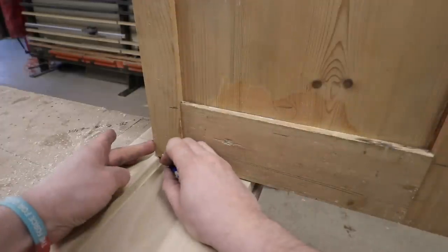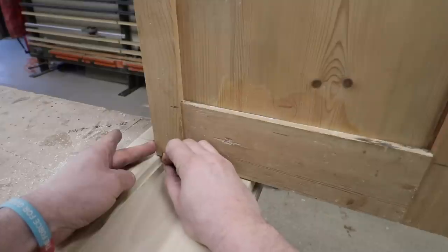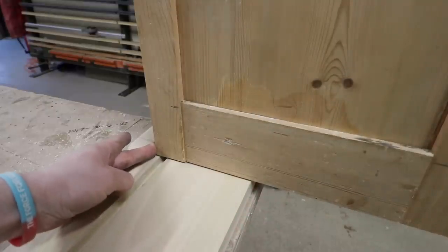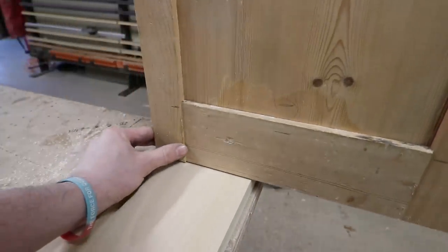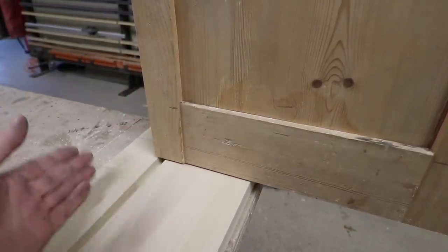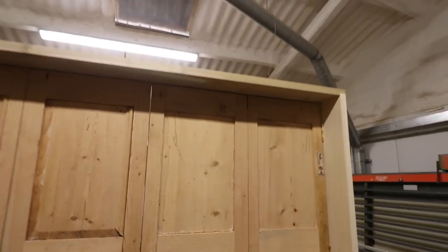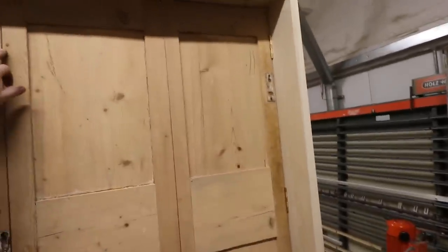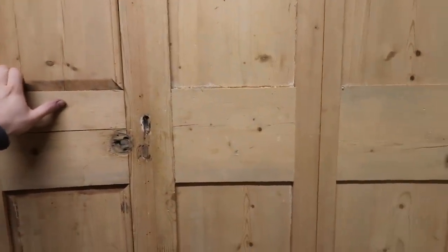That's going to help me when I drill this hole in the end of here for this guide pin. It'll just give me one more millimetre of material to help support it, so to keep it nice and strong. So I'll take them to bits, take 1 mil off the length of the short doors, chop the hinges in again, another mil deeper, and then should be about right. There we go, I think we've got about the right gap now. So there's about, I'd say, 2.5 mil in the middle, which just allows the doors to pivot, because they get a bit closer as you pivot that.